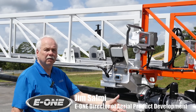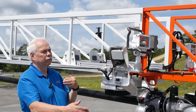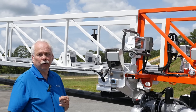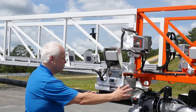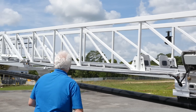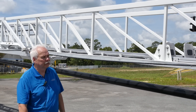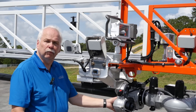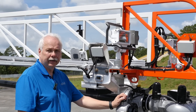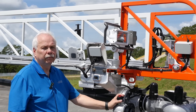The monitor currently is in the water tower operation mode. We retract one section and use a pin to replace it, and we operate in the rescue mode. This assembly is attached to the monitor and the whole carriage can move backward and connect to the end point in the rescue position. We're also using a valve-under-monitor configuration which allows us to do a hand line as a pre-connect, so we can run a standpipe operation and run hoses into a building.